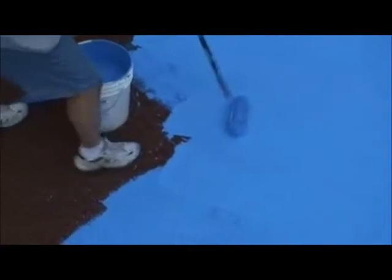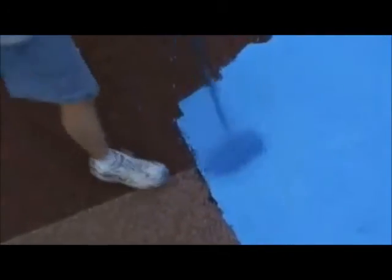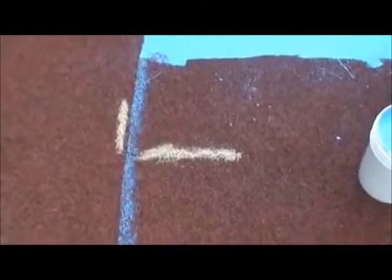It is important to understand that the surface will not look good after a single coat. Gravity pulls the coating down into the porous wear layer and it will not look aesthetically pleasing even if you use twice as much material. After the first coat dries, most of the pores will be filled so the second coat can finish the job at a rate of roughly 400 square feet per 5 gallon pail.